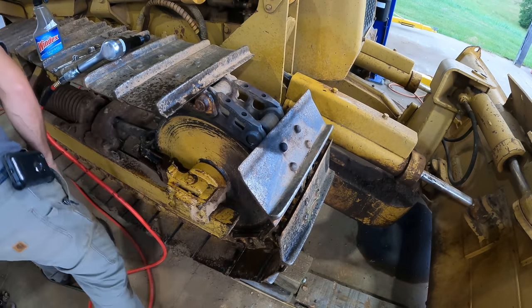That means I need to pull the hood off, the air filter off, the exhaust stack off, get all that out of the way, pull the valve cover and see what's going on with the glow plugs. This thing is one thing after another. I ohmed out all the glow plugs and they all ohmed out okay — actually all about one ohm. The wires initially did not have a connection, but once I started moving them around they did get a connection. So I have a bad wiring harness. I was actually able to cause it to lose connection by moving the wires. Definitely a bad harness.